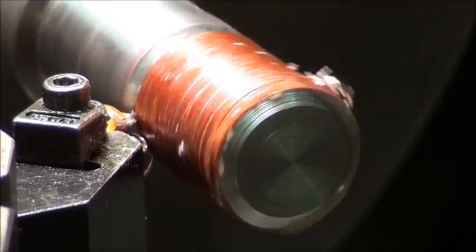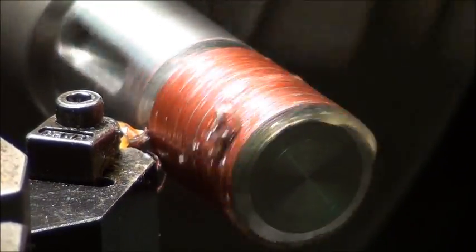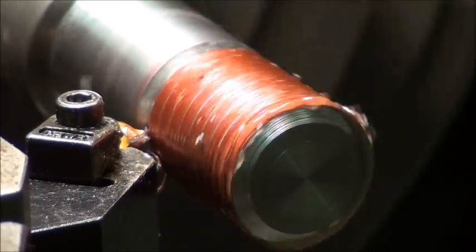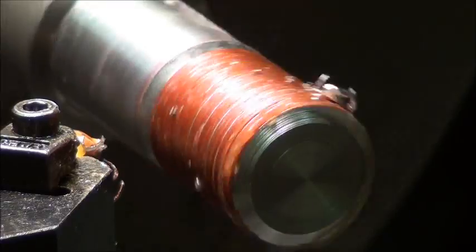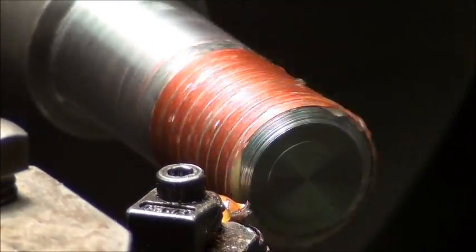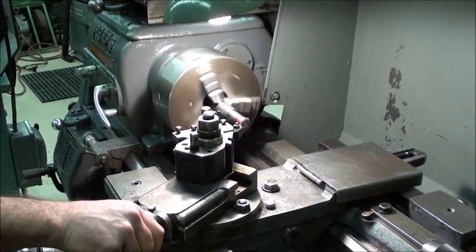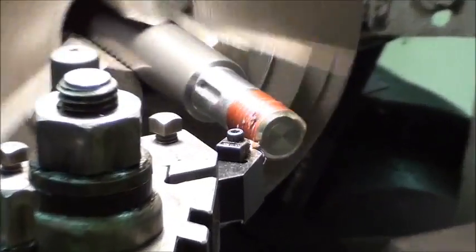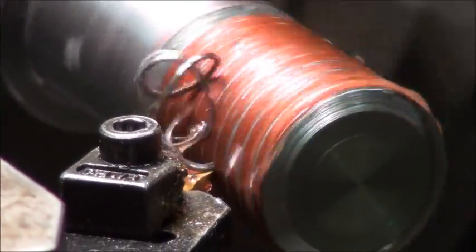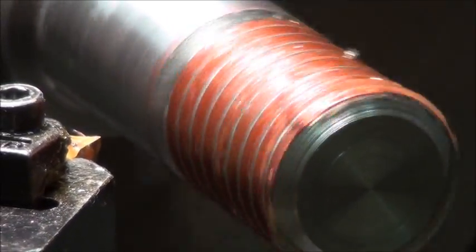If I had a real crazy shoulder out here, I may have to be two-handed — can I get out quick enough? But because I've given myself that escape, it gives me somewhere for the tool to go and not have to worry about hitting anything. Then I can move the tool out, line it back to the start, and bring it back to zero. Because I'm on zero, I know that I'm right at my start point. Once again — move in. That's the size I'm shooting for. This time I'm on three, but it still engages the split nut correctly. You know right away if the split nut's not right because you'll end up with kind of like a double or messy looking thread.